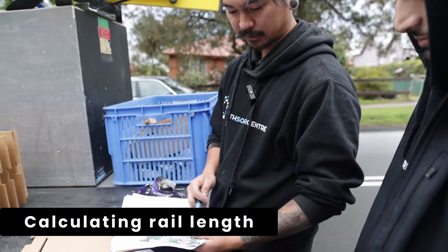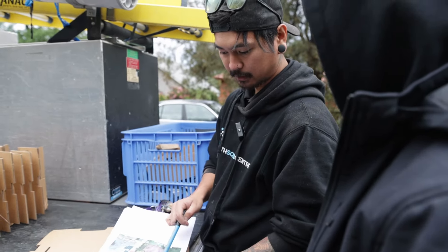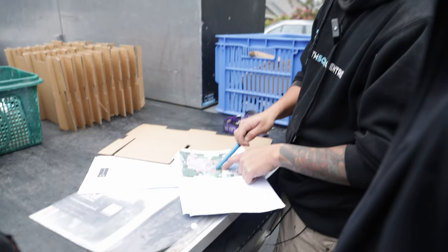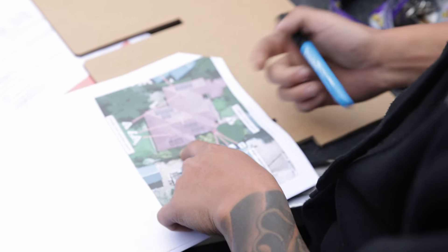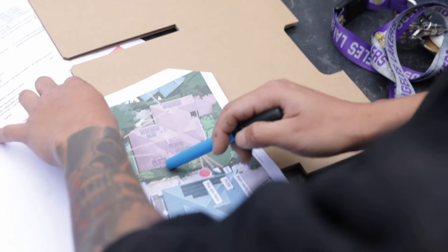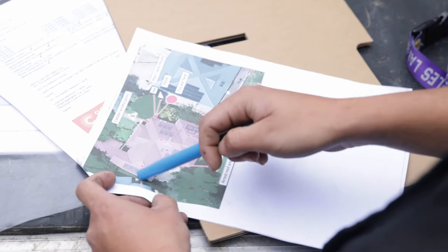So you've got one, two, three, four faces. Currently you've got three faces designed portrait and this one in landscape. Over here if you look closely there's actually a shared rail, so these two panels will share rail at the top. We're going to work out how many rails we need, but first we'll do the portraits first.